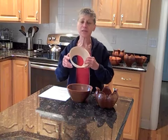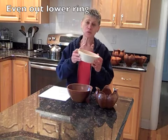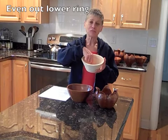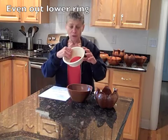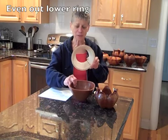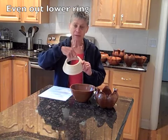And this appears in almost every instruction that I write for a bowl. As you probably know, if you've made bowls, you glue up your rings first before you glue them to the base, because once you attach them to the base, you can't access the bottom of the ring without sanding ruts and things into the base and making it look like a steak board. So you look at your bottom, and you see if it's nicely contoured. That's what people will see if they look straight down into your bowl, and you don't want things looking irregular, little bumps. Best way to see it, look at the back. There are fewer distractions, and any little irregularities will show up.